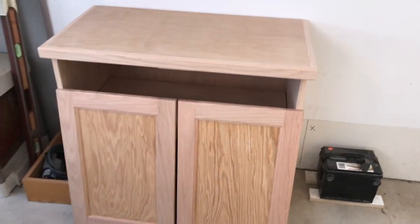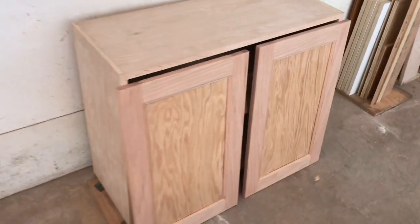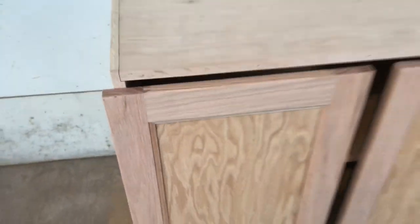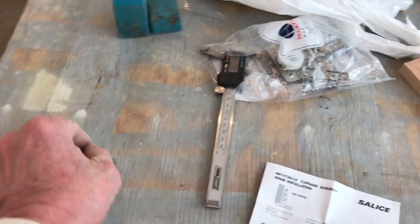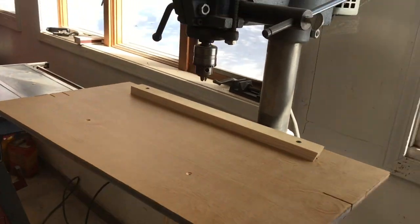The doors are done. There's the two doors that are going to go on the base cabinet, and over here is the upper cabinet and the two doors that are going to go on that. They're 100% done — this part of the door has been clear coated; the stiles and rails of the frame have not been finished yet. The next thing to do is to hang the doors. I'm going to use this European-style hinge — it's a nice hinge. It takes a 35-millimeter bit to drill on the back side of the door to hold it. I've got the drill press set up with a drilling jig and we'll be ready to drill the back of the hinges.